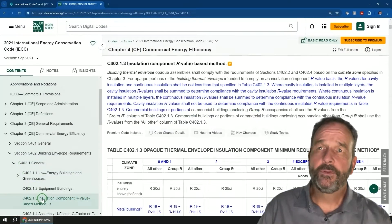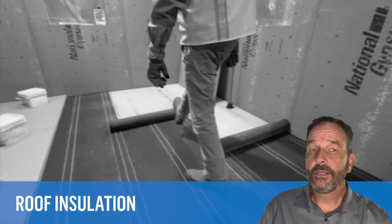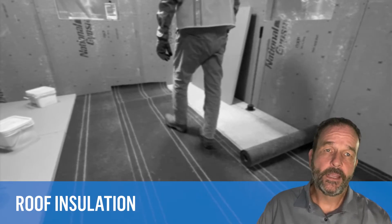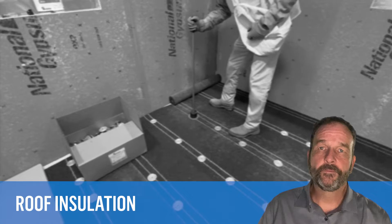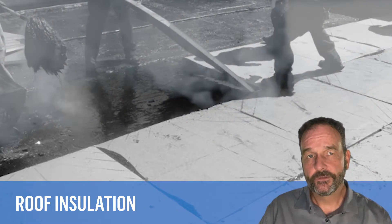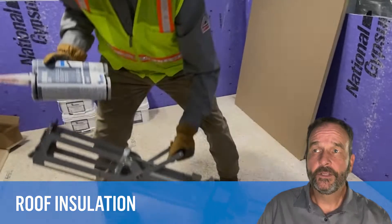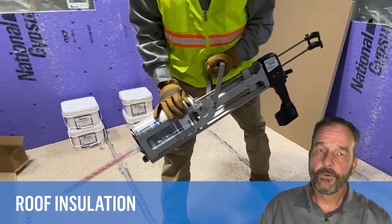Over the past few decades, there has been an increasing demand for roof insulation. So the membrane base sheets evolved into an anchor sheet or carrier sheet used to secure the insulation to the roof deck, and asphalt was commonly used as the insulation adhesive. But today, insulation is typically adhered using ribbon-applied, low-rise polyurethane foam adhesive.